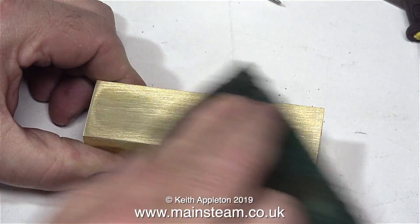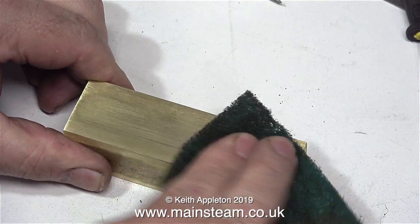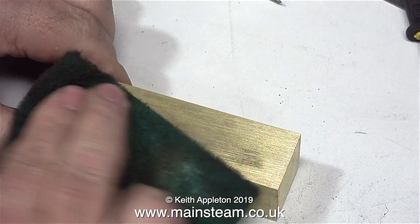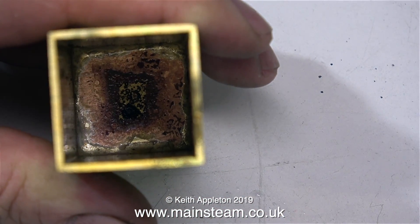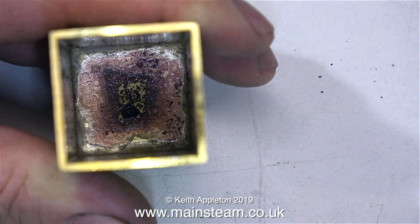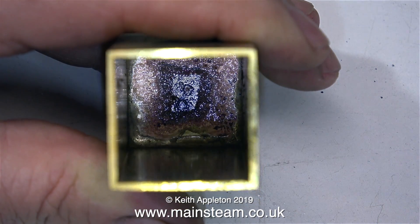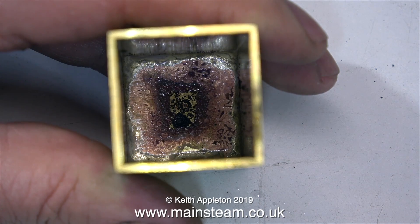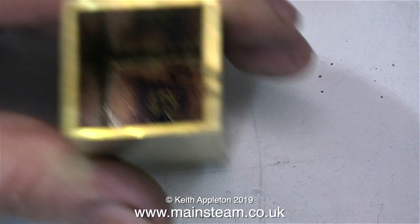Now it's time to clean up the surface with some Scotch-Brite, just to smooth out the scratches left by the belt sander. Later on I'll be polishing this up and doing a bit more work on the surface, but this will be okay for the moment. When I look down the end of the box section you can see how much silver solder has flowed into a fillet around the joint. This is a very strong joint and it's never going to leak. And that's it for this one - thanks for watching and I hope you found it useful.